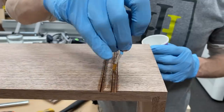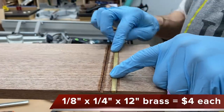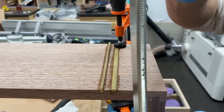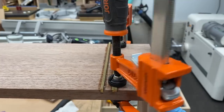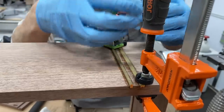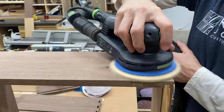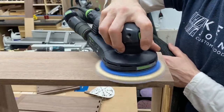I did another version with brass bars — I cut some tight-fitting grooves on the table saw for the brass to slide into. Because this was a little experimental, on one side I did a quarter inch with an eighth inch next to it, and on the other side I did two quarter-inch strips next to each other. For more information on the complications and pitfalls of working with brass and wood, please refer to the aforementioned video, How to Level Up Your Drawers.